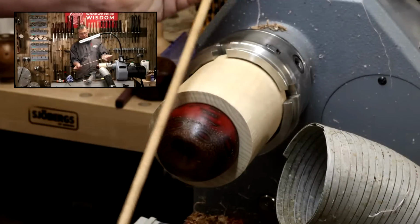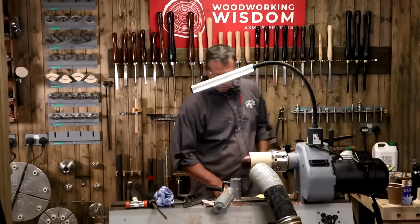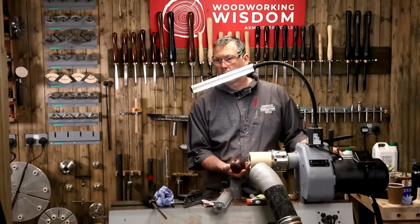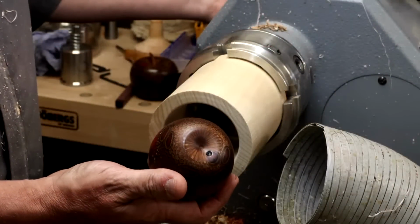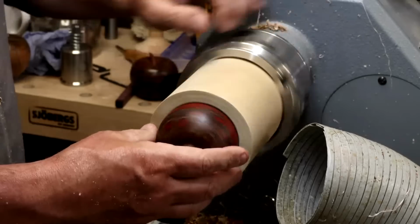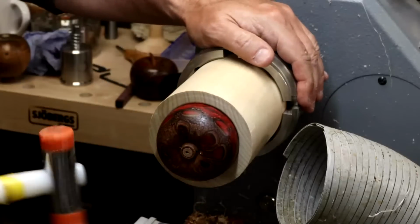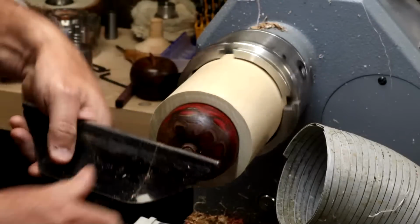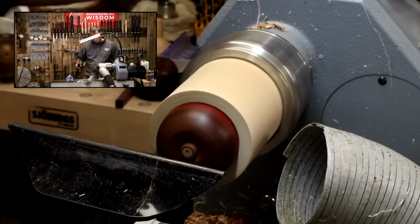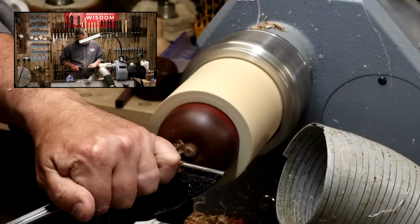Beech dowel, soften one end, and that's going to be our knockout stick. Don't use your normal knockout bar, otherwise you will damage your pieces. Flip them over just to show you what we've got there a minute. All right, and then we're going to flip them over, next side, roughly center it up, then give it a tap. Slightly off center doesn't matter, because whatever you do, you're going to even it up. You're going to make it round.